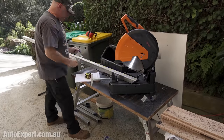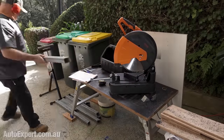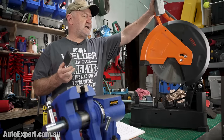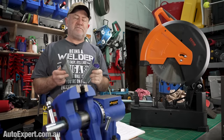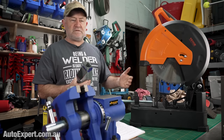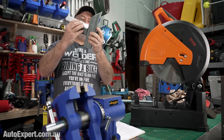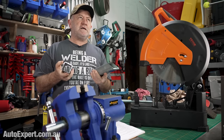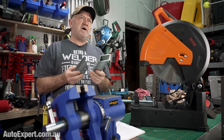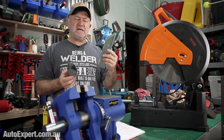Step one, you're going to have to cut it up. This is some 50 by 50 by 3 millimeter thick galvanized steel tube and I cut about 30 different bits of it yesterday using this saw — a Vivo 14 inch, 355 millimeter tungsten carbide tipped chop saw. You can orient the fixed jaw on the vice to plus or minus 45 degrees, so you can cut pretty cool mitres, T-joints, and whatever else you need to build the kinds of things dudes build out of tube like this — substantial gates, privacy screens, fences, and things of that nature.